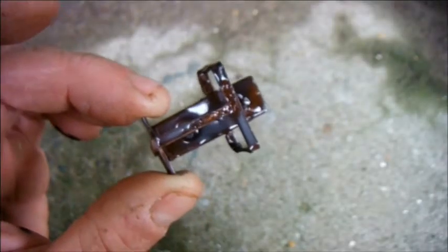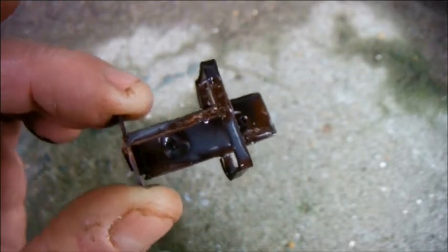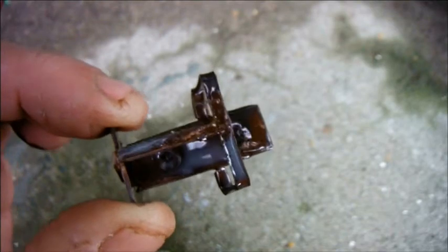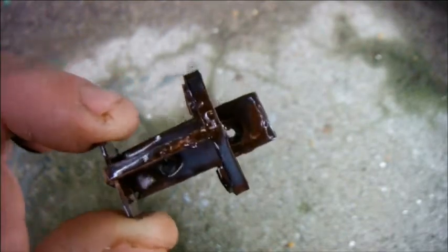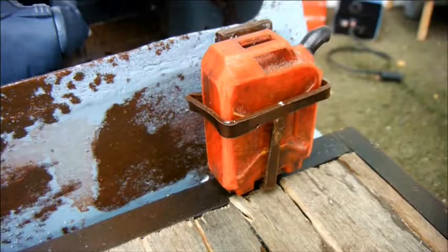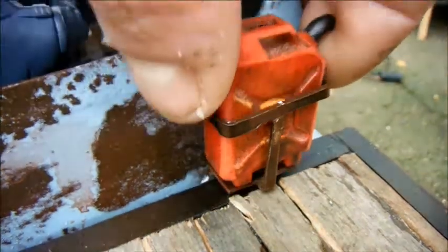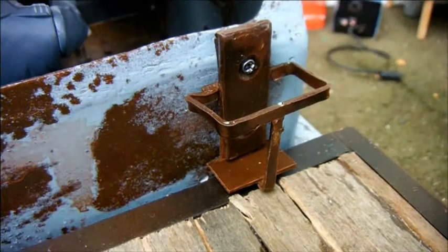I've just sprayed it on, and I can actually see that it's attacking the paint. The paint's all bubbling and turning grey, and I'll be very interested to see how it looks when it's dried. I sprayed that lacquer on far too thickly, so it wasn't a fair test. After it had finished dissolving the paint and turning it grey and bubbly, it did actually all dry the original colour and slightly more matte. But I think I owe the stuff a better test before I condemn or praise it.